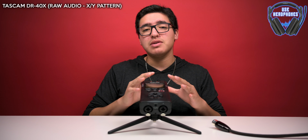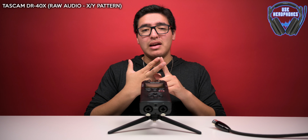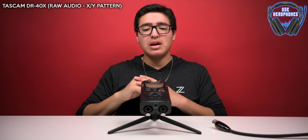The way I have it set up is, first, you guys are going to be hearing the raw audio. You are not going to be hearing any edited part in this part of the video. Second, I am recording at about -6 decibels. I'm using dual recording, so the second one is at -6 decibels. The limiter is enabled, and I have the volume level at about 55. I wanted the background noise to be under negative 45 decibels, and I wanted my audio to be around negative 18 to negative 12 so that it doesn't peak. Hopefully you guys will be able to hear that, and then in post I will be bringing up the volumes here and there just to match with all the other recordings that we're going to be doing. So let me know what you guys think.